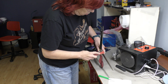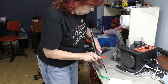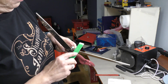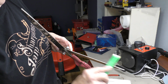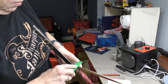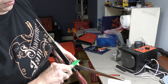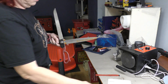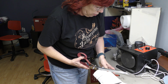The diamond files come in — we sell them in three different grits. You can get them from our website, or probably from a Bass Pro or any place that sells knives. These are DMT. You see how I'm following the angle of the edge and going down — I'm not square, not at right angles. I'm following the edge of it, and that will pull up a little bit of a burr. This is not the best way to sharpen, but it will do in an emergency — just bring up an edge. Make sure you're at the same angle as the edge on these shears. Then you can cut the burr off once you've created a little bit of burr.